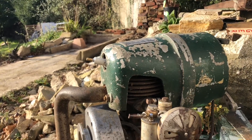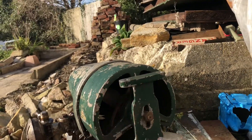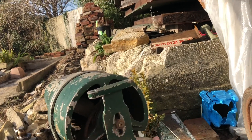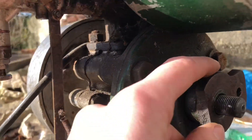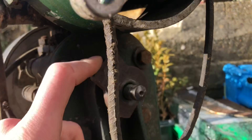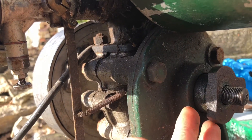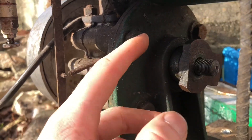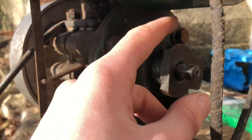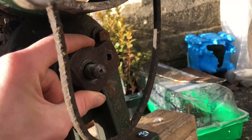Towards the back of the engine we've got a little housing here, which would have been mounted somewhere on the generator — bolted in with a shaft connecting underneath. We've got this flange which must have connected to another flange, but unfortunately half of it has been broken off. I don't really need it; I want a clean shaft coming through. As it's threaded, I'm going to have to make a sleeve to fit over the shaft so I can put a bolt on and make it a standard uniform smooth shaft, so I can fit a simple centrifugal clutch.